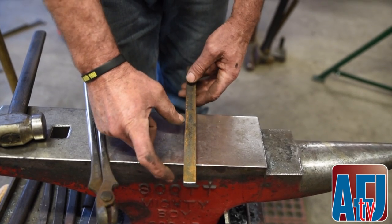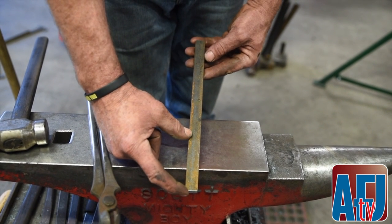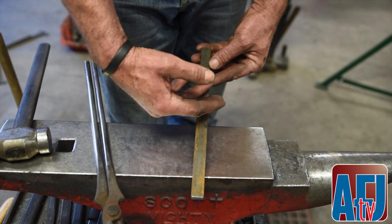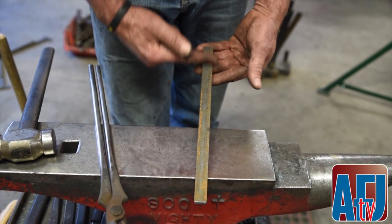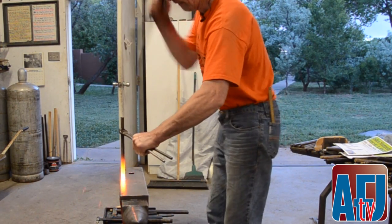We're going to work on the medial heel first. We're going to do a little bit of a bump. We're going to upset about 2 3/4 to 3 inches, and give a little bit of lift to the medial side. So we're going to make a ramp. The shoe is a spiral shoe, so we're going to add material to this side and take away from this side. We'll do a couple heats on the medial side first, and just bump up the end.